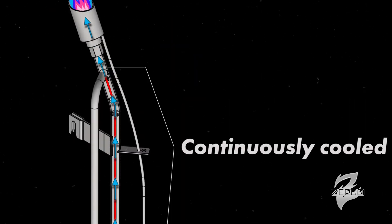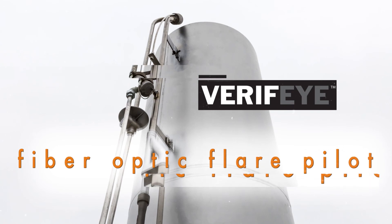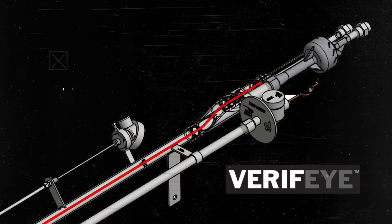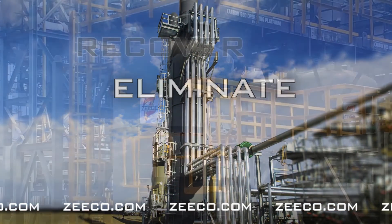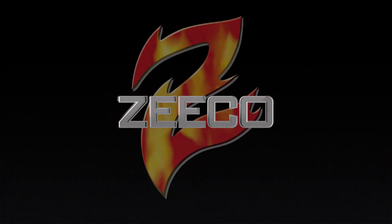We've developed something that is typically higher temperature suitability than the pilot itself, effectively eliminating thermal cycling or thermal damage from being one of the root causes of failure. We have confirmation of each individual pilot, a technology that is robust, going to last from turnaround to turnaround, and we've finally put together instantaneous detection. The purpose is to provide the safest, most reliable system for knowing the status of your flare pilots and therefore providing safety for the plant.